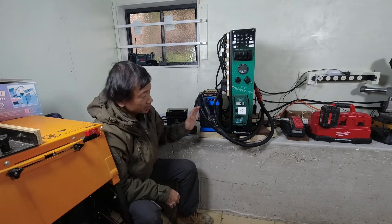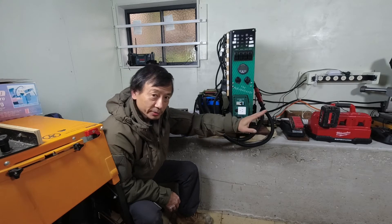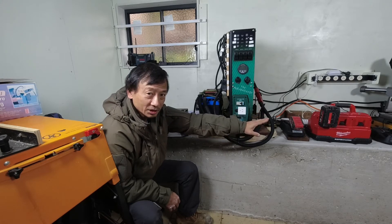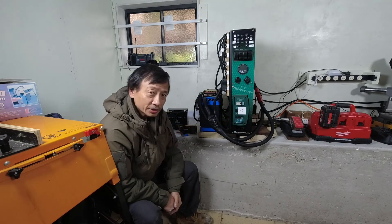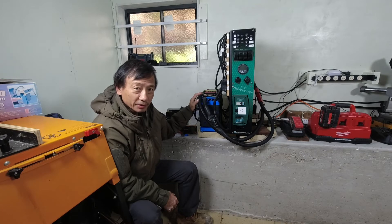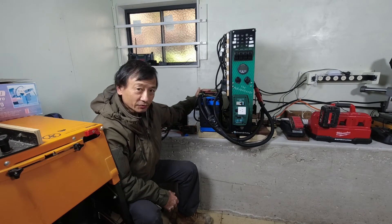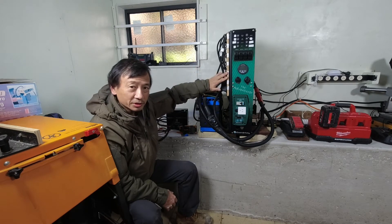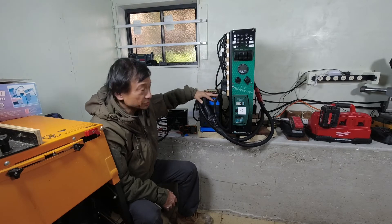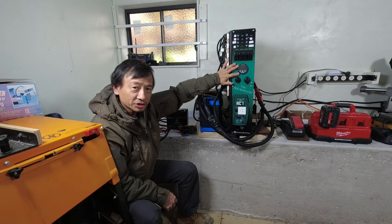So over the course of several weeks, I used the inverter to power up chargers for my Bosch 18V lithium batteries as well as my Milwaukee 18V lithium batteries, and I also charged several nickel metal hydride low self-discharge batteries. I let this occur over several weeks, draining the full 240Ah battery down to the point where the battery management system shuts down because the voltage is too low. At various times during the process, I recorded the voltage using the ePro battery monitor, which is connected to a shunt, recording the voltage versus the state of charge of the battery.